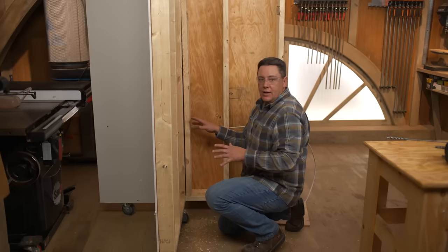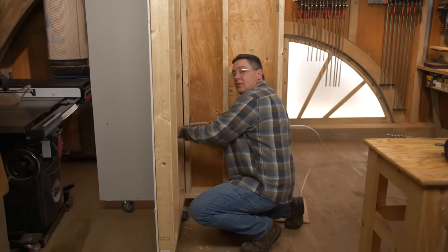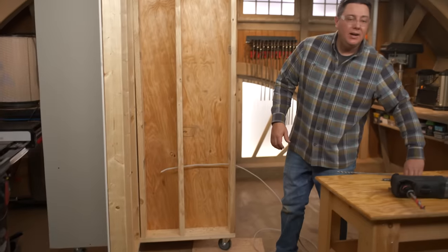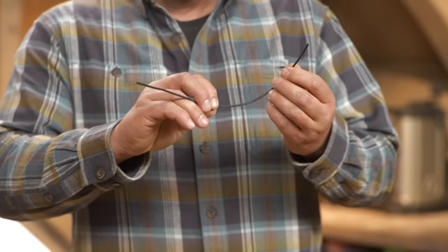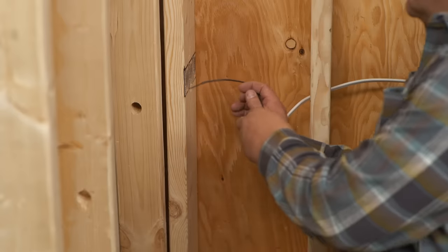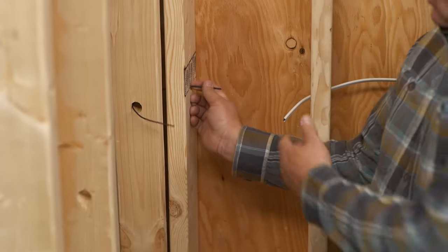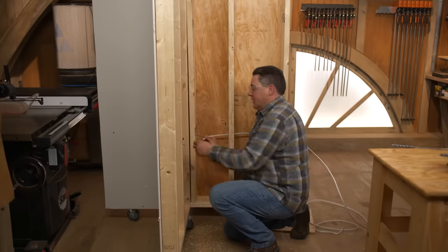Let's say you had a corner that was much tighter — a couple of two-by-fours, or holes that weren't perfectly lined up. There's another trick for that. I'll take a single piece of wire about this big, put a little curve in it to get it started, and use it like a fish. I start it in and try to make that corner — and as you can see, that shorter piece goes through a lot easier than an entire wire. You'd simply tape your wire to that piece and pull it through to get around the corner.